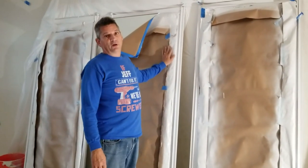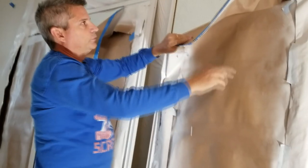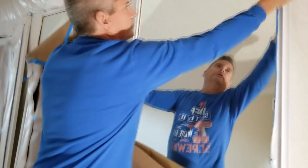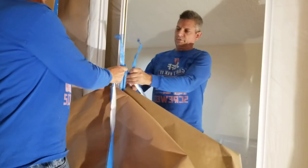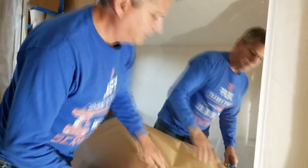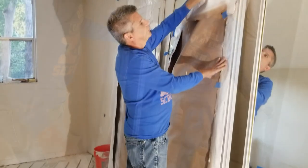All right, so our three doors are all painted now and it's dry, so now it's time to peel off the tape. We're going to get started on that — you just peel it right off. You might see a few specks here and there that you can clean off later, but overall it's looking pretty good. Just peel off all your tape. You can see a little bit of overspray did get in here — we'll just come in with some paint thinner and clear that off. It's amazing how it can still find its way around paper and tape. If you don't have good 100% contact with the tape onto the paper, sometimes it'll blow under it. Now we start the center door.